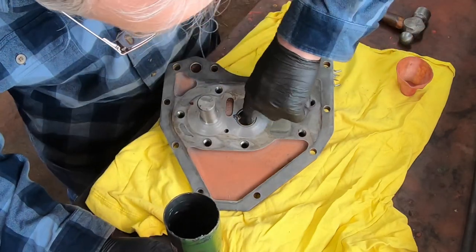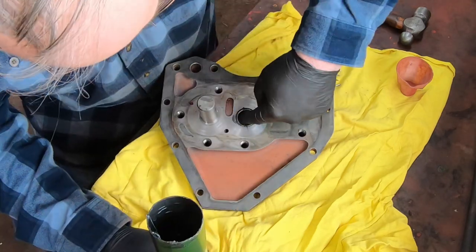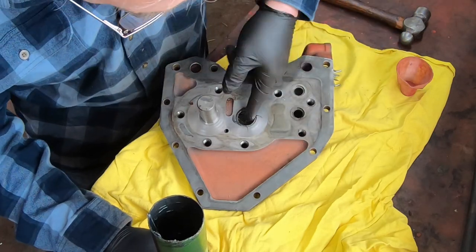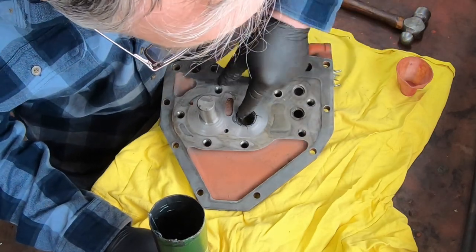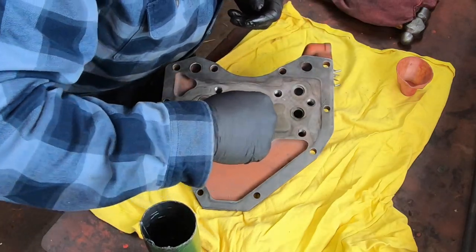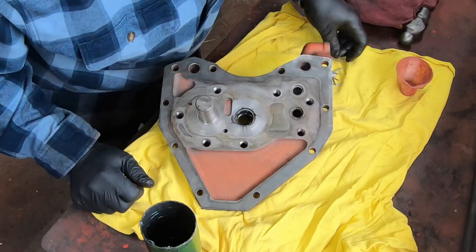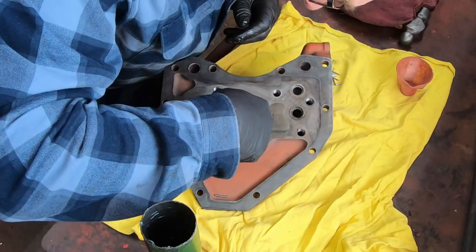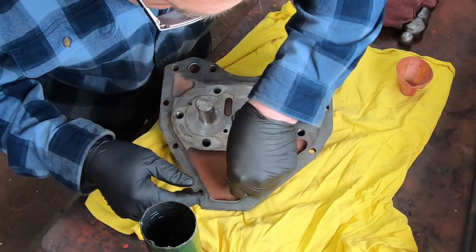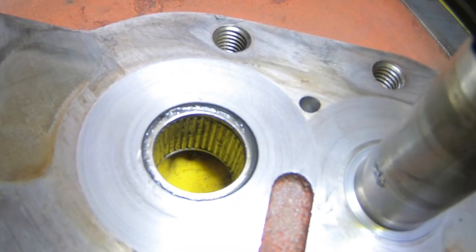This pump is pretty unique from other lift-alls in that originally these were bronze bushings in here, but this one has all needle bearings. Not sure what the deal is with that — I didn't read of any manufacturing change, but that may be so. We'll just put these little guys back in here, get them all lined up. They've got to slide in at an angle past the flange of the bearing and then straighten out. And that's what the needles look like all stacked in there, greased in place.